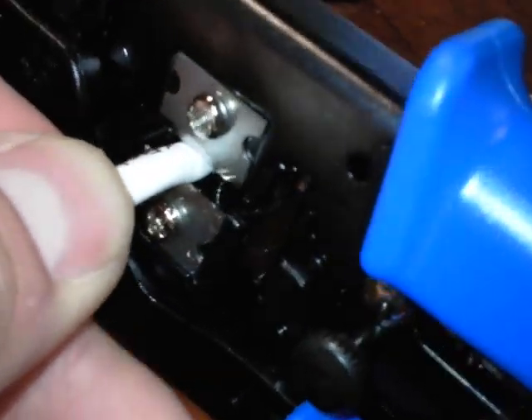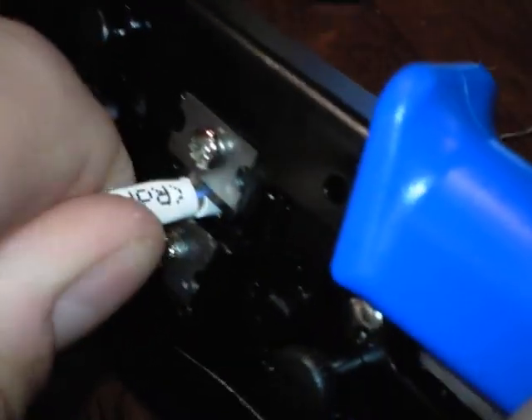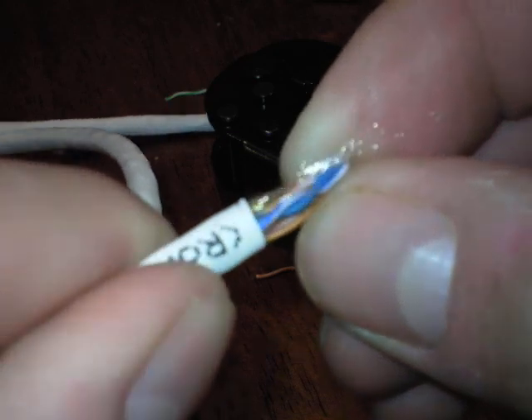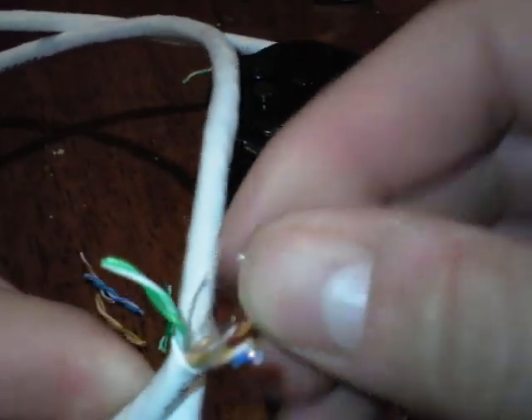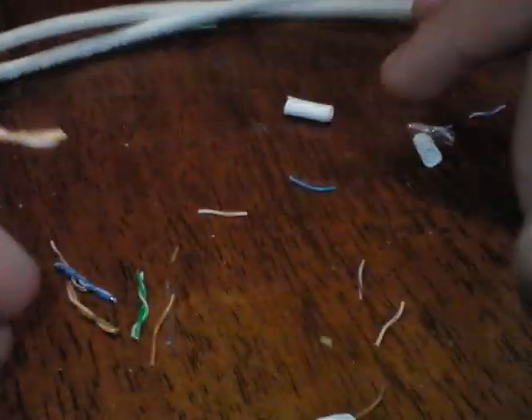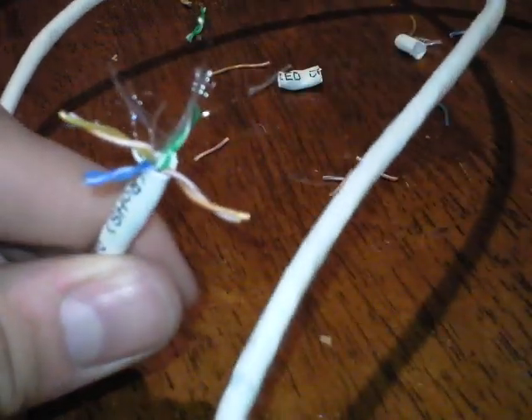You want to score it just slightly to make sure it's flush on that side. Don't go too far — keep it flush right to the edge, and then apply just slight pressure. Don't squeeze down, then twist. The key is it easily damages interior wires because they're so tiny and skinny. Now you want to separate all of them.